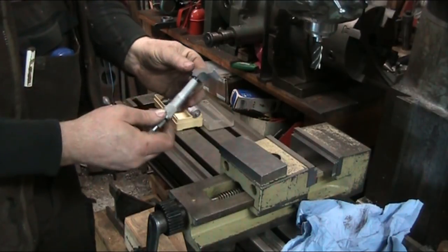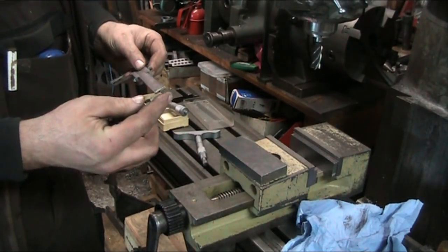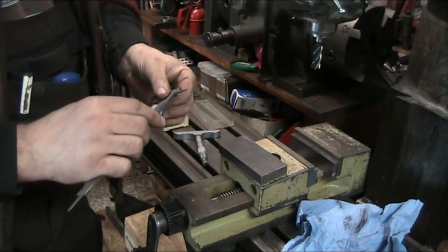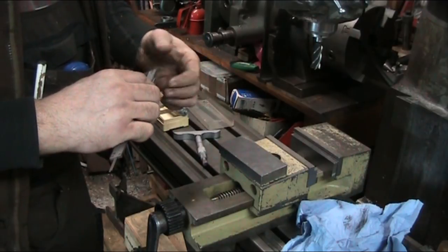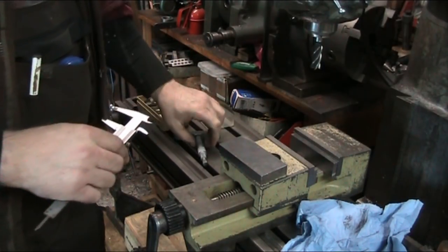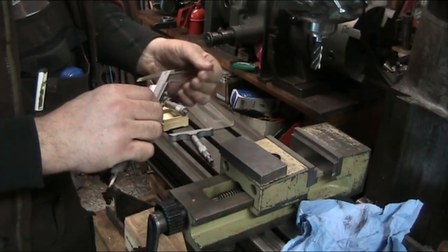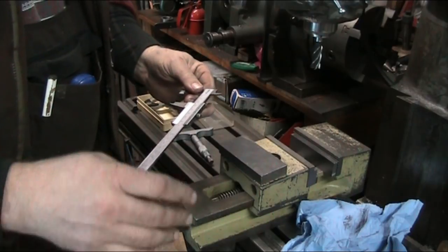Okay, our measurement instrument for today is going to be the depth micrometer. We could use a regular set of calipers with the stinger on there. These do work in a pinch for projects that aren't terribly accurate. These are accurate. These are Mitutoyos. I don't particularly care for them. It's an old bias from trade school. When I was apprenticing, they were considered low-end measurement tools. They are good for what we're doing here with them. They'd be plenty good enough. But again, we're going to use the depth micrometer, so that way we have a higher degree of accuracy. For the average home gamer, a pair of these calipers, Mitutoyos, would be more than plenty good enough. Personally, I prefer Mauser. I have two pairs of them at home, and they're hard to beat, although these come fairly close and they do a satisfactory job.